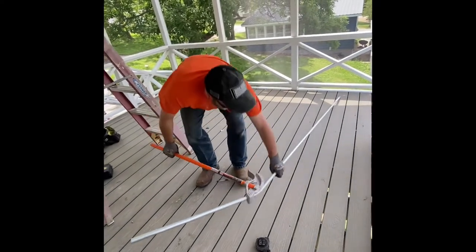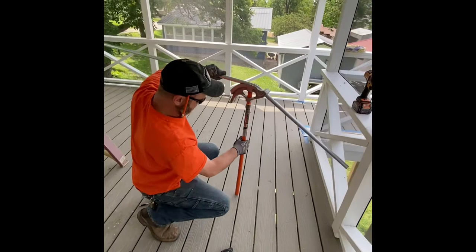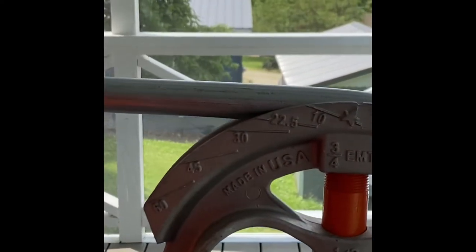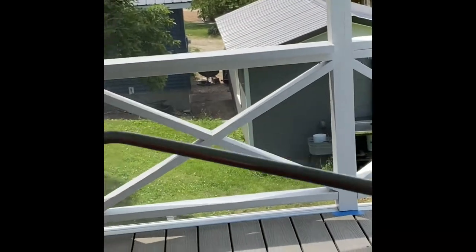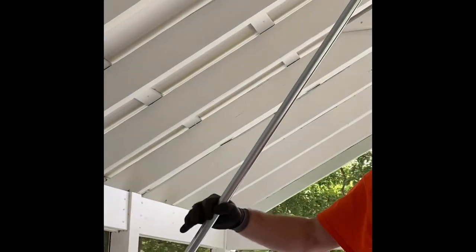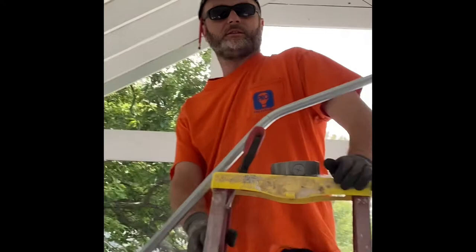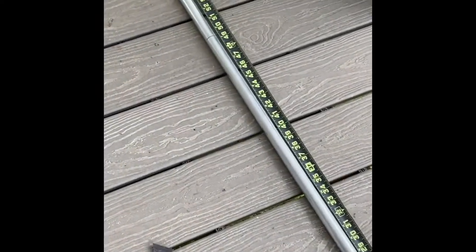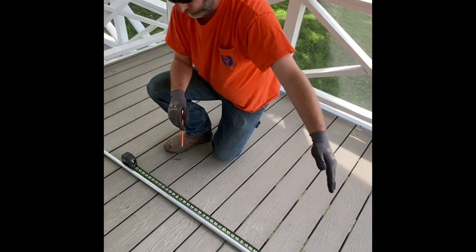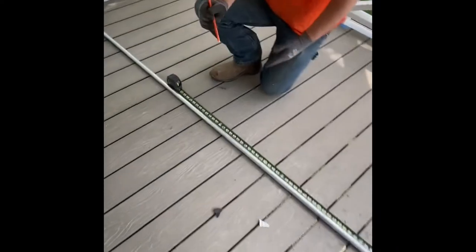We can take our level, or just stand the pipe up straight — you'll see the bottom runs parallel with your 30-degree mark. Unfortunately we can't get a good test because it's a 10-foot stick and we've got screens. So I'm going to go ahead, pull the rest of the measurement, get it bent, and we'll see how it fits. We measured the distance between where the bend is and down there, then transferred that measurement to the pipe. My 27-inch mark is set, and the distance between the bends came out to 49 inches.